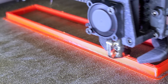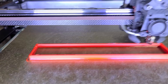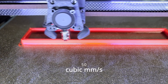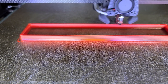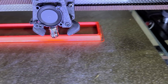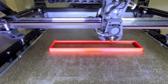Let's go to 100 millimeters per second — that's 200% of the original 50mm/s. Well, here it is, it's printing fine, no issue at all. I have not tested pressure advance with a one millimeter nozzle and PETG, so obviously the corners are a bit weird, but the layers are good. It's not under-extruding — it's keeping up.